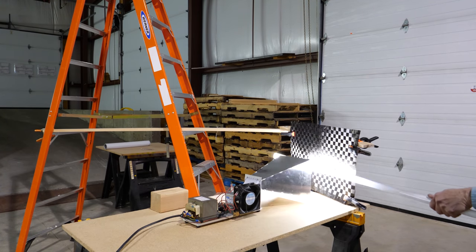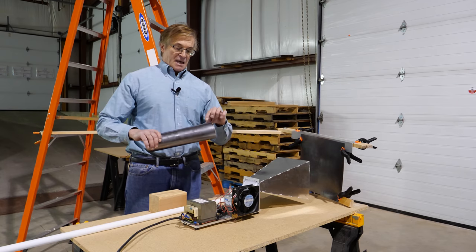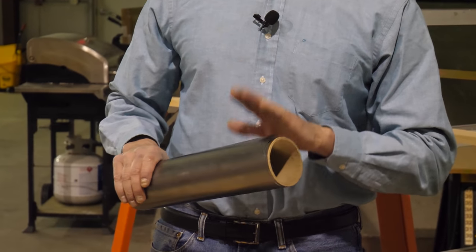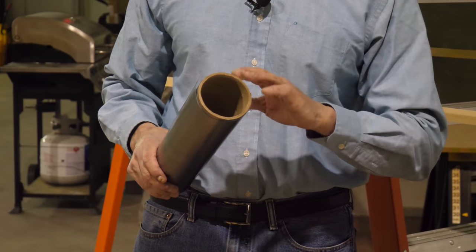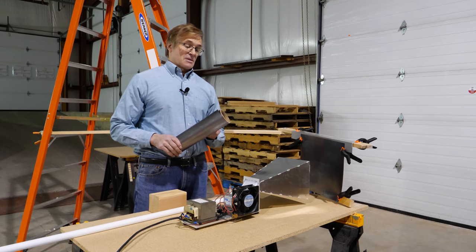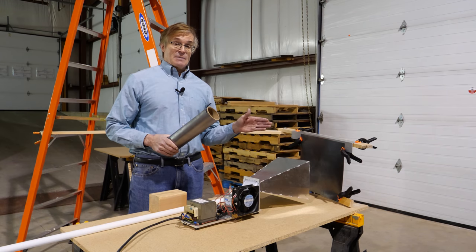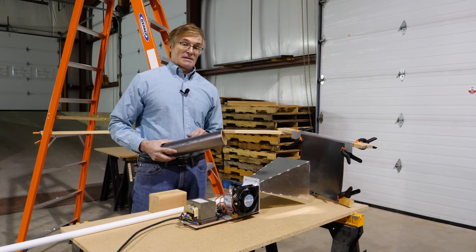This material is graphite film. It's also 250 microns thick, and it's formed from hydrostatically pressed graphite. It's often used as a heat spreader in electronic equipment as well as high-temperature gaskets in furnaces. It's also an excellent material for exfoliating graphene, as we'll show you in a future video. But the bottom line is this stuff is inexpensive, it's very flexible, it's soft, and it's electrically conductive.